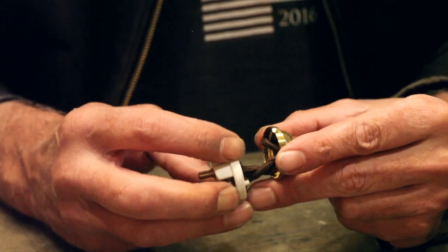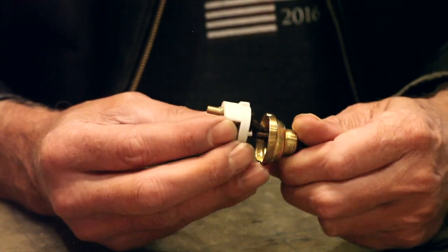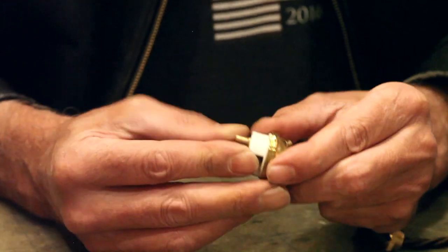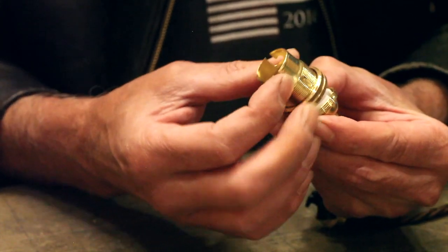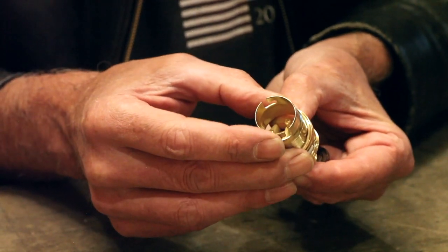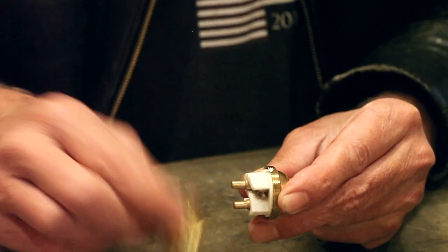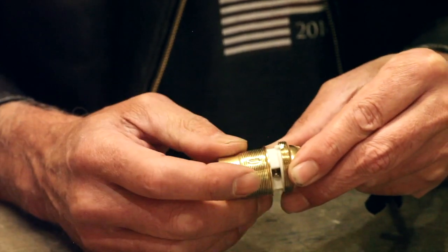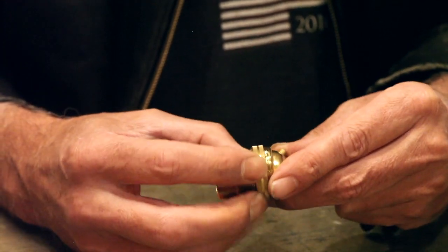What we've got to do now is line up this slight groove with this indentation. We have had customers wire these up without aligning them and they will sort of go in, but this is absolutely critical for a bayonet — it's made to line up with a little tab here which gives the orientation of the two pins versus the two bayonet parts, so they do need to cross over correctly. There is a little tab here that lines up with this indentation in the ceramic, so we lock those together and put on the ring to connect the two halves.